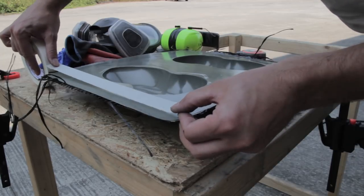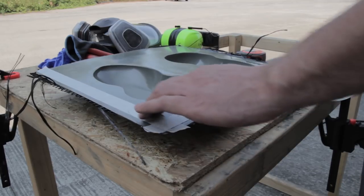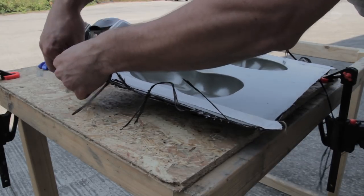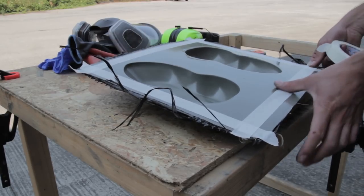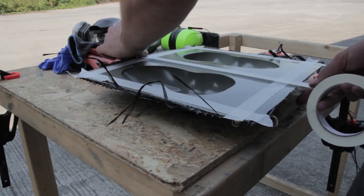Because the temperature rises so slowly, the mold post-cures without deformation and with a perfect finish. After post-curing you can sand and do small retouches — but do not retouch before post-curing, as marks can still come through. Also, if you have too many air bubbles in the backing layers, they can expand during the heat cycle and create small craters in the gel coat surface, so avoid air bubbles between layers during the layup.